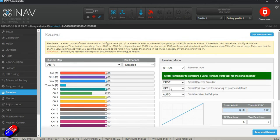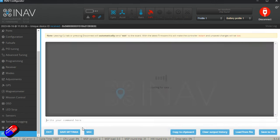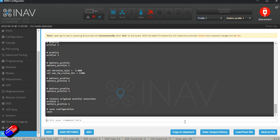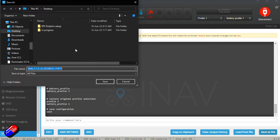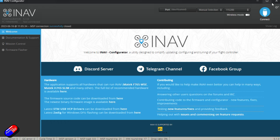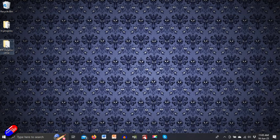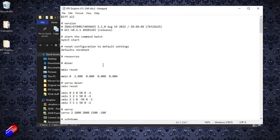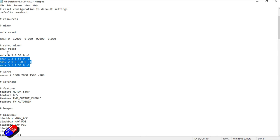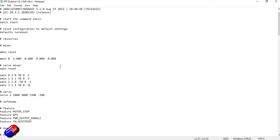So what we're going to do is copy all of this configuration and save it so we have a backup to pull from. I'll save a diff.all to the desktop with a name I'll remember. Now if we disconnect from the model and close this version of the configurator, we can open that diff.all file to see what it looks like. We can see the settings we'll probably copy across, including the servo mix. We can get rid of things we're not going to use.